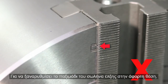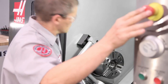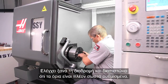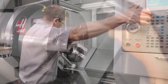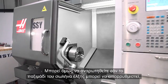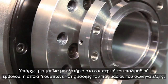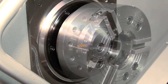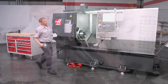Then he rotates the draw nut two and a half turns in the counterclockwise direction. This will position the master jaws close to the correct point in their travel range. Now energize the chuck and check that the number one master jaw indicating mark aligns to the travel range marks in both the clamped and unclamped states. Andrew notes that the jaw indicating mark does not retract far enough with the chuck fully unclamped and travels too far as it reaches the fully clamped position. To readjust the draw nut in the unbound state, he presses e-stop again at the midpoint of master jaw travel and rotates the draw nut one and a half turns counterclockwise to move the jaws outward. He checks the travel again and finds the limits are now correctly set. When clamped, the entire chuck and draw tube assembly is held tight by clamping force. There is a spring-loaded ball inside the plunger nut which locates and detents on the draw nut — the ball clicks into place, locking and maintaining its position. Reinstall the chip cover. The top jaws can now be installed and this chuck is ready for operation.